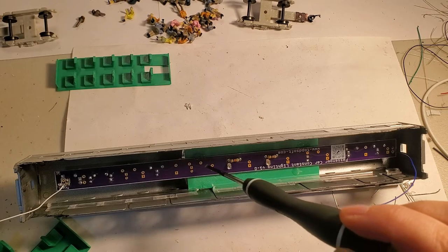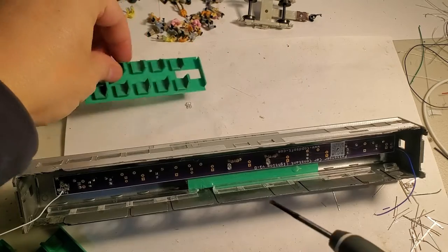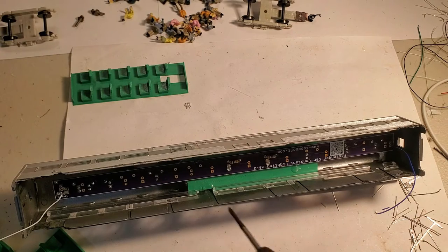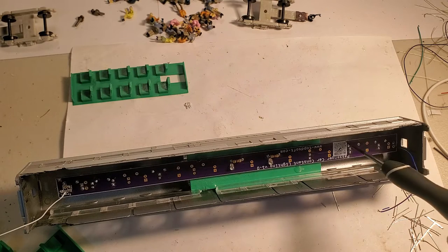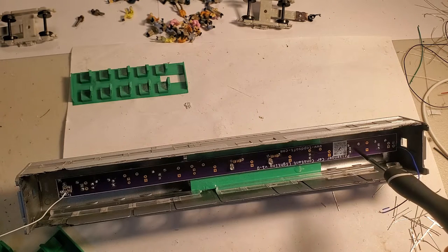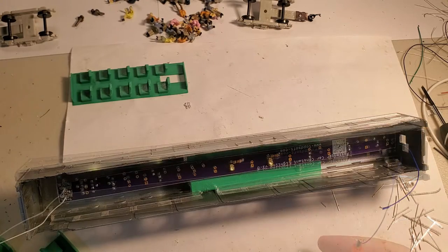The issue I had is that normally I would take this and mount it directly to the ceiling, but I can't here because this dome is in the way — there's about a centimeter gap. If I'd done it like normal, all the components would be on the bottom and you'd see them through the window. So what I did was mount most of the components on the top side of the board, up where you can't see it, including the LEDs — which actually works out pretty well because the ceiling being shiny silver means the LED shines into it and really diffuses out.